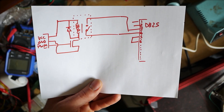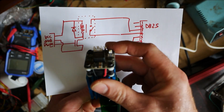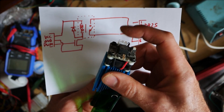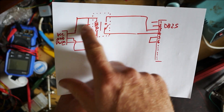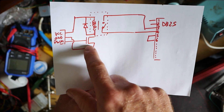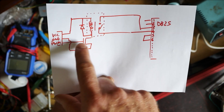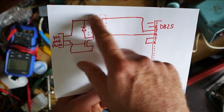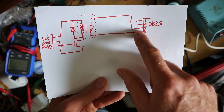The first step is to make sure that the X1 Pro can be controlled by the gerbil controller board on the laser, so we're basically connecting here where the old laser was. We've got 3 wires: VCC power, ground, and the pulse-width-modulated output, which doesn't have enough power to drive the relay directly, so we're using a FET. Then the switch output on the relay goes directly to pins 3 and 4 on the DB25.